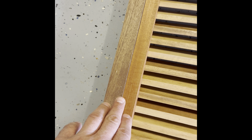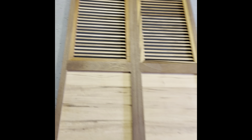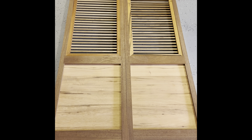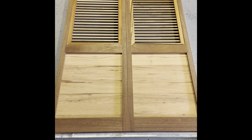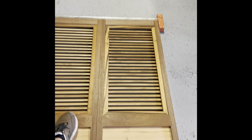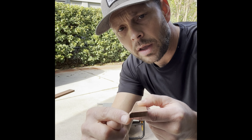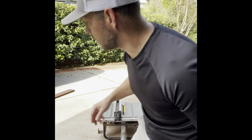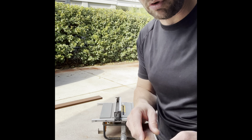I inserted all the slats and then trimmed up some border here to hide everything. I'm going to do the same on the other side — just 45s, ripped down some tigerwood to make it fit, which really finished it off nicely. I'm curious how much this trim is going to raise up when I flip it; I'd prefer it not to sit proud of the frame. I'd like it recessed, and if it isn't I may change it. I also may use a nice piece of rosewood I've been sitting on for about three years for some molding down here.